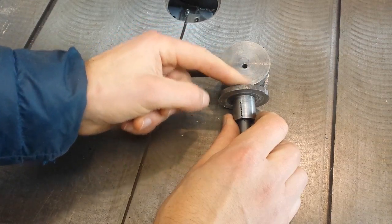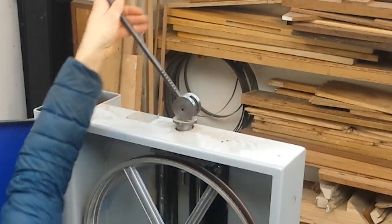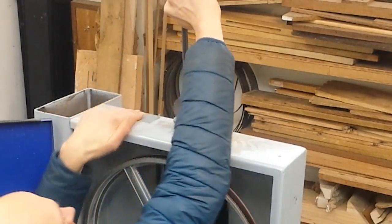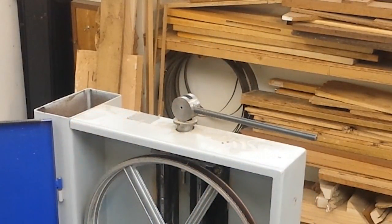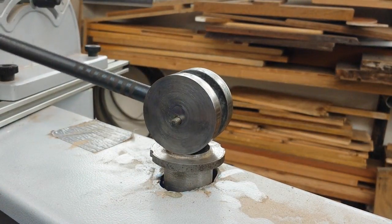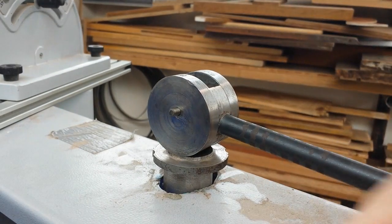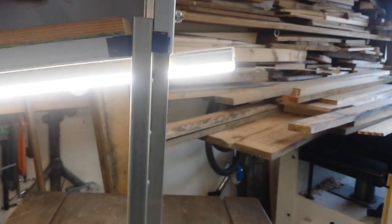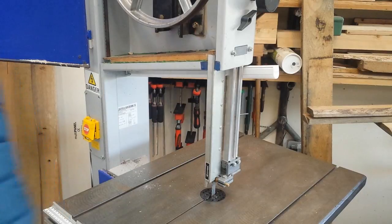This distance is now bigger when used to tension the blade. I know there should be some nice technical way to measure the tension but I just do it by feel — you can quickly get a sense for it by moving the blade guides all the way up to max depth of cut and just twisting the blade from side to side. The quick release tensioner is just an easy win and I'd recommend it to everyone. Here's another one I'd recommend: it's just an LED strip light under the frame, gives a nice even light for cutting. It's cheap and easy.